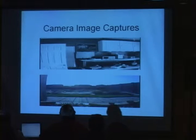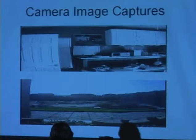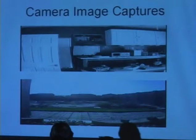Okay? Now, here's some camera images. This is to credit Jerry's house. This is Jerry's. So what you're seeing here is basically Jerry managed to get the FPGA programmed up to where it actually took the NTSC scan and put it into the memory. And what you're seeing here is a memory dump. So this is not a slow scan image, it's actually the memory dump, which is just a significant step. And that we're controlling the video chip, we're getting it into the RAM. Now the next step is for the microcontroller to address the RAM, extract only what it needs and format a slow scan image, and then of course send down the tones, which will be the slow scan image, and then you'll be able to receive it and decode it. So here we're getting to see Jerry's backyard and his laboratory. I don't know if he really realized that once he took these pictures, the rest of the world was going to see them. But this is quite an exciting step.